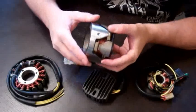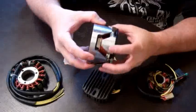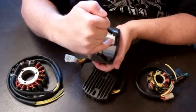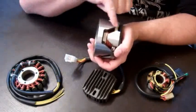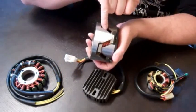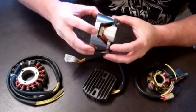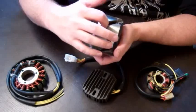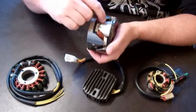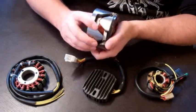The main important features of these rotors: we use a really high quality casting — the metal core is extremely solid. A nice feature is the field coil core that we wind them on. We have a really nice plastic core that protects the field coil windings — you can see the white right here inside the two halves. That provides a really stable base and protects the coil. We use extremely high quality wire with high temperature insulation, and we're expecting these to last as long as the stock rotor did.